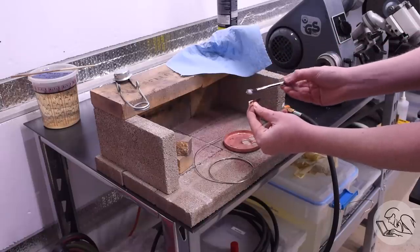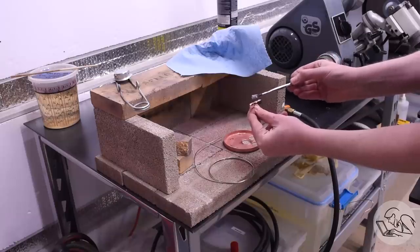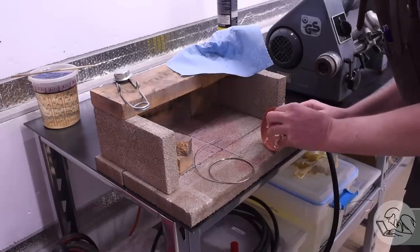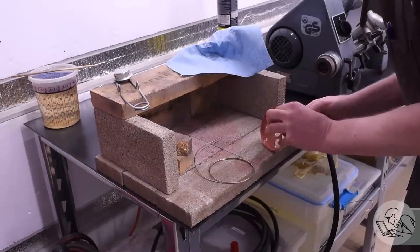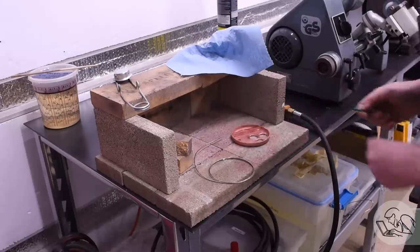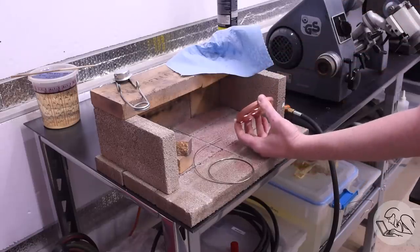The silver solder needs to flow all around all of these parts, or it could be a leak. These fixturing screws may just be temporary for assembly, but they are also sources of leaks, so you really have to be careful. And don't be stingy with the flux. A lot of people are stingy with flux because there's a persistent myth that silver solder follows the flux while you're silver soldering. It's not really true.